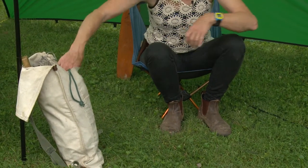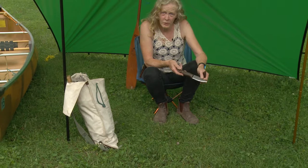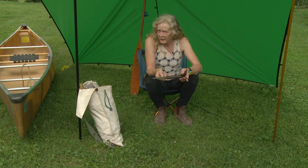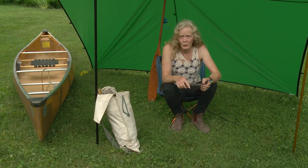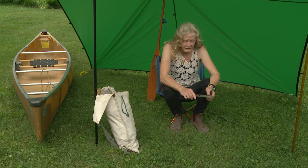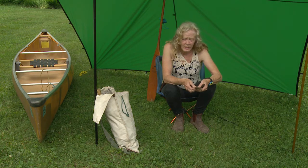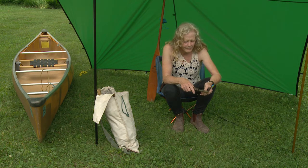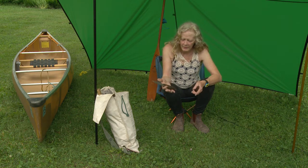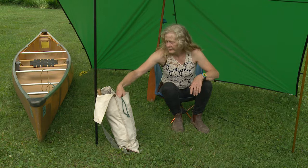The A2 steel is fairly hard. I wanted to compare it a little bit to the Condor Bushlore. I found this knife a little bit softer. I think it's 1075 steel, which I'm not sure where it puts it on the Rockwell hardness scale, but probably in the 50s, high 50s, 56, 57. And I believe this is a little higher. It's just hard to grade because it really has to do with the heat treat in the end. The Bushlore is a full tang, and it's got a nice handle shape, but it's not quite as nice a carving knife as my new Puuko. Thank you, Tidera and Bushcraft USA.